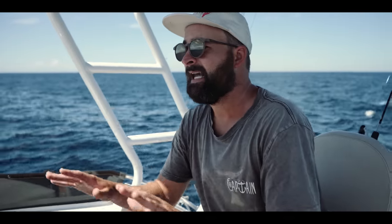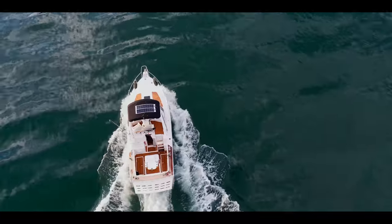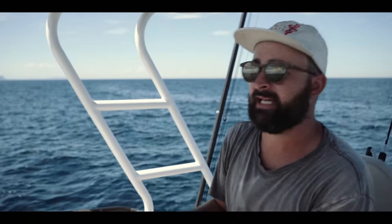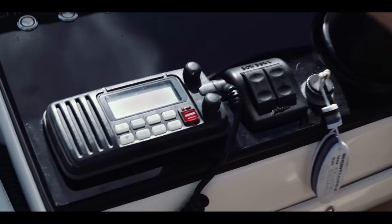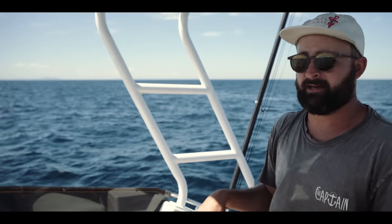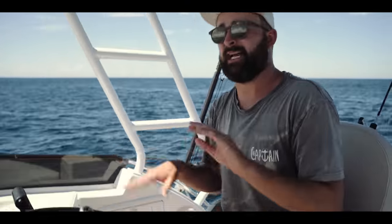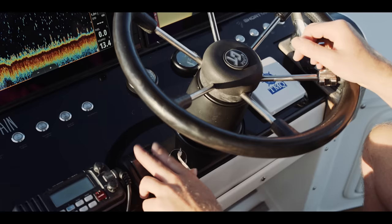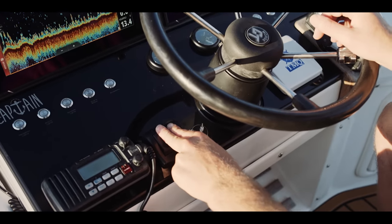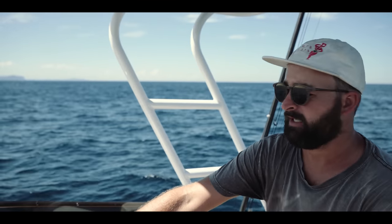So we're on the Black Watch 26 and we're going to run through the process to get this beast onto the plane. It is a heavy boat and doesn't have a huge amount of horsepower, so it takes a little work. We've got the original trim tab system — just two black switches, up/down for port and starboard — so you're guessing a lot of the time where the tabs actually are. I'll just leave them up to avoid confusion and zero them both out into the upright position, trim the stern drive right in, and start giving a little bit of throttle.